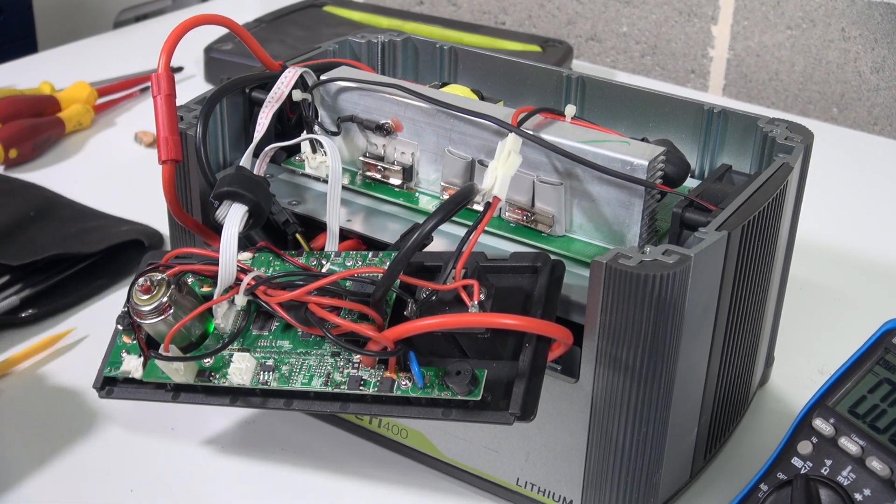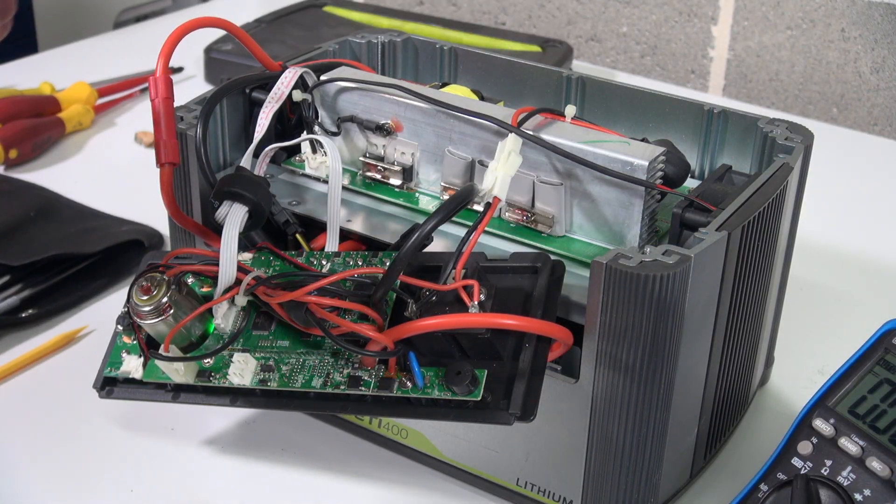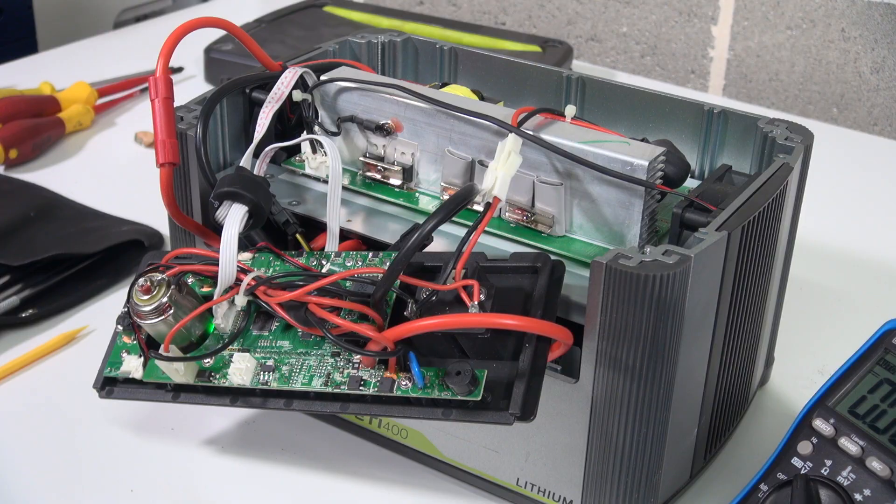That wasn't possible to test. But if you encounter an under-voltage situation on your battery, and if you have access to the individual cells — or not the individual cells, because there are multiple cells in parallel here, and there are four in series because it's a 12.8-volt pack — they've put four parallel strings in series in this thing, and the battery management system will be tapping off each one of those strings to balance the multiple cells in series.